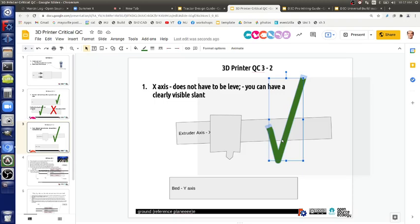Maybe if you've got everything just perfect, you've optimized your printer with more advanced stepper drivers that have smoother steps, which don't vibrate as much, and things are more steady, or if you're going at super slow speed, you can still probably get decent prints under extreme conditions. But anyway, that's just to get an idea. You're going to be asking, how accurate do I have to make that offset? 1 millimeter under is good. The bigger nozzles make it easier for you to print because you have higher tolerance. The heat bed helps, I guess.